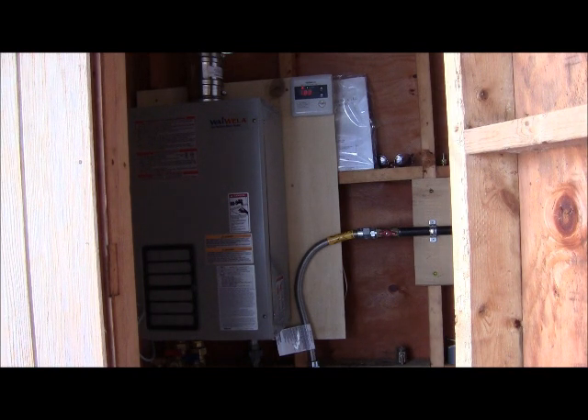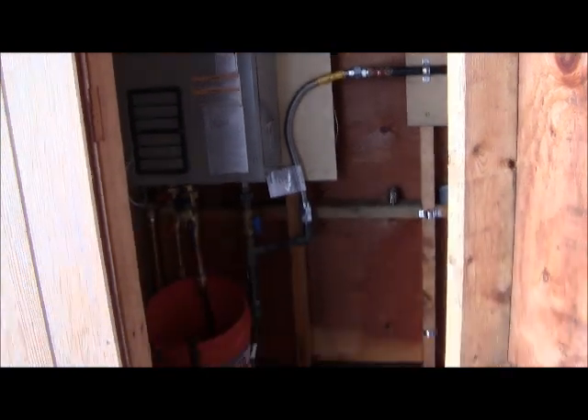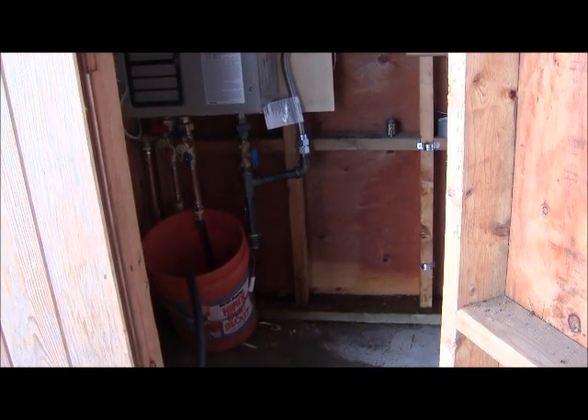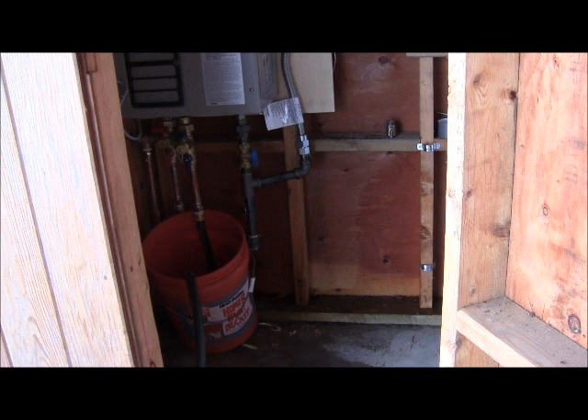The reason I'm using a higher temperature than that 150°F mark is to account for heat loss — I'm buffering in enough temperature so that as the water travels from the system at the bottom and runs to my tank, I can account for some thermal loss. Also, just from the tank itself as it sits out here in the cold weather — today it's not too bad, only close to 40°F, which is pretty good weather for towards the end of December up here in Wisconsin.